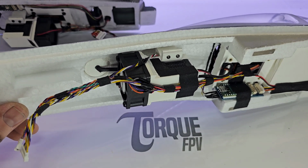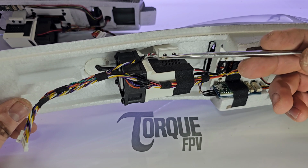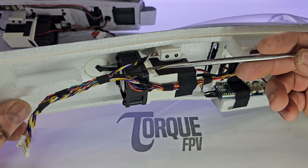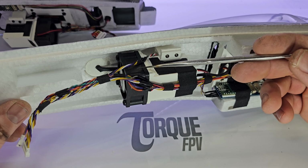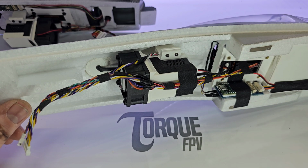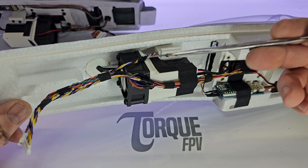I did talk to someone on YouTube, through Messenger from the groups, and he was saying that he found some 24-volt fans that he tried and they worked really well. He gave me a part number. I don't remember what it was, but I'll try to find that and link it in the description as well. So if you guys are running a 6S system, you don't really have to worry about running that regulator if you find a 24-volt fan. But like I said, I've just used these 12-volt fans. I bought a pack of 4, so rather than buying new ones, I just use what I had.